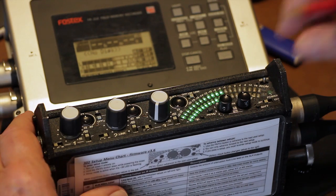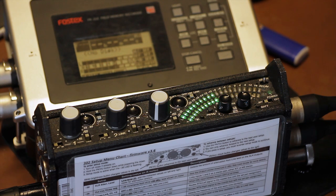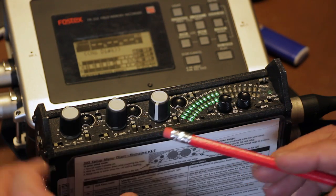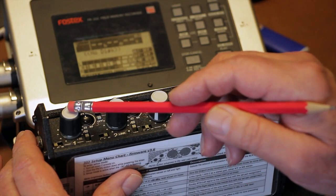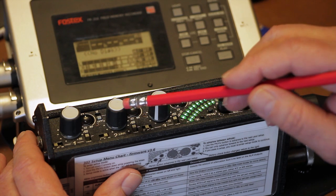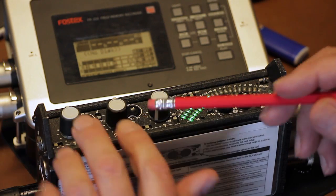RTN Return gives you the stereo mix coming back from your camera or recorder — you need to have wired the device to the mixer return input. You can buy a dual XLR cable snake that includes a stereo 3.5mm line, and the better ones have a quick release for use at the camera end. The last three positions help you record MS stereo for mixing in post. Channel 1 is the mid mic going to the left bus, and channel 2 is your figure-8 side mic going to the right bus. MMS monitors the mono signal, or the left channel, of an MS stereo signal. STMS processes the mono left and right channels as MS stereo for your ears only in the headset, giving you an idea of what the MS stereo will sound like when you have manually built the mix down in post.